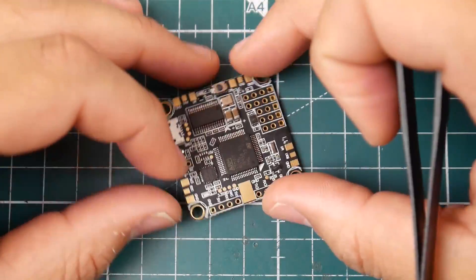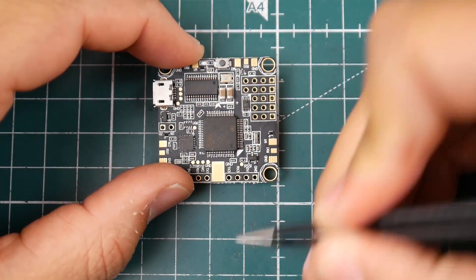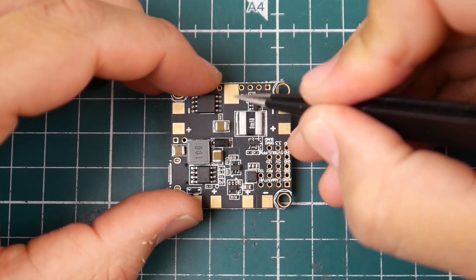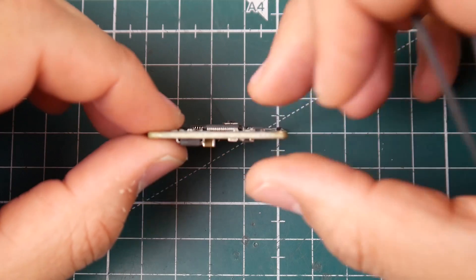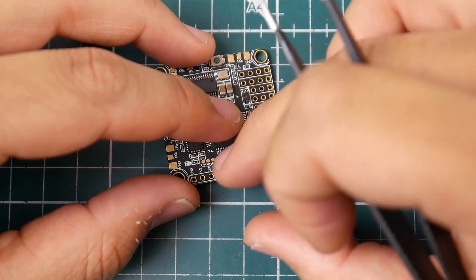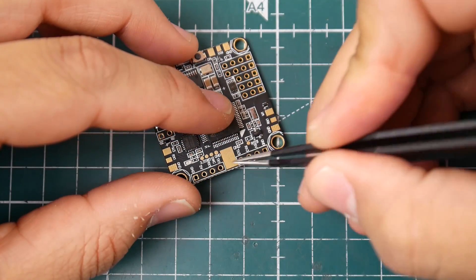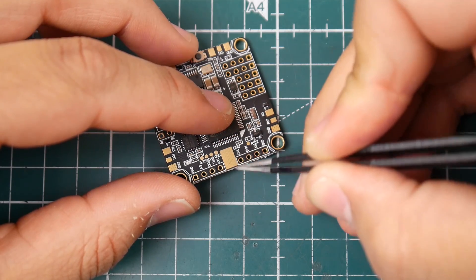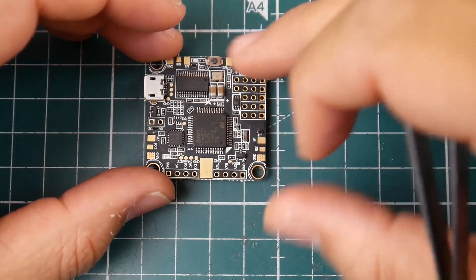To connect your battery — for example your XT60 connector — the ground goes here and the positive goes on the other side. But you have to be careful because the spacing between the pads is very tiny, about one millimeter. Don't let solder or wire hang out beyond the pad, just keep the silicone wire right up to it so you don't risk frying everything including your battery.